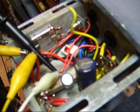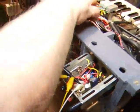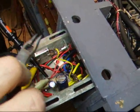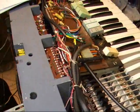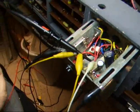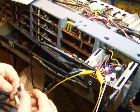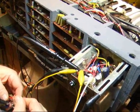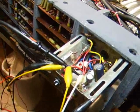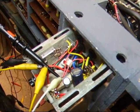I'm seeing a Zener across this, so I'm going to unhook our friendly neighborhood Zener so he's no longer in the picture. I'm still seeing this — it's getting hot rapidly. I must be dissipating more than an amp on this power supply.